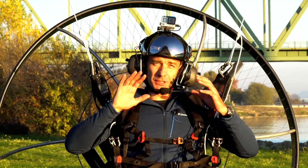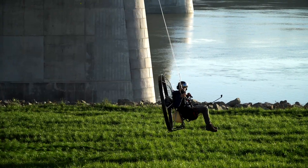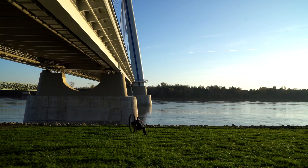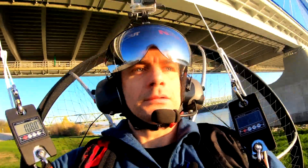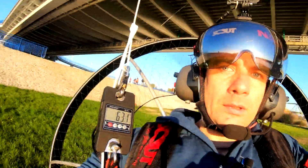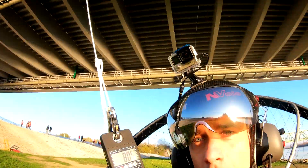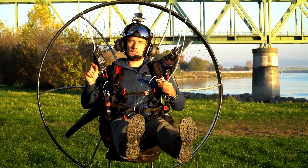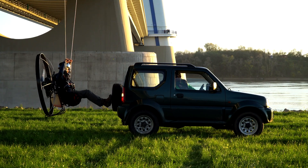This experiment didn't work out very well. When I applied thrust, I tried to hold it stable at 5,500, 6,500, and full throttle, but after a very short while the whole thing started to swing left and right and I couldn't keep it stable. I'm sure it affected the reading on the scales and I was unable to read it. The next improvement is to stabilize by stretching my legs and having some support on my feet. When I apply throttle, I will be stable but will not affect the torque, because the torque is twisting me rotationally and I will only stabilize the forward motion.